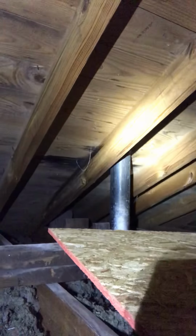All right, so we've got that. We've got a leak over here at the plumbing vent. Okay, plumbing vents. Brand new roof on here. So why is it leaking? I'll tell you why it's leaking. I haven't been out there yet, but I guarantee what we're going to look at is the old vent, or the old plumbing boot on the vent, and that probably is compromised, and they just put it right back on. I see that all the time. The rubber around that boot is just deteriorating, and water gets in. It always gets in. Water, water, water. We talk about that all the time. All right, so main thing, ventilation, wiring, always the wiring in an older home. And then this guy over here, we've still got a leak, and it's a brand new roof. So again, flippers, be flipping.